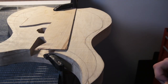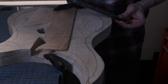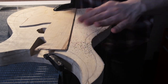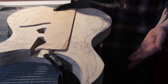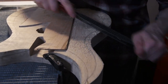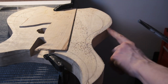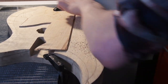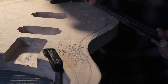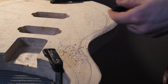So we're going to start off with the Shinto saw rasp and begin taking away the excess material. Work holding is one very important thing — my work desk still isn't the greatest, but it gets the job done for the time being. Basically, I'm easing my way into that depth that we marked out. These are very handy — they have two different sides: a very coarse side which takes off a lot of material at once, and a finer side which will kind of finesse things a bit. At first we're just going to use the coarse side to whittle it down.